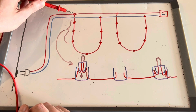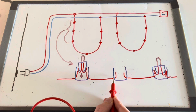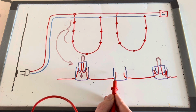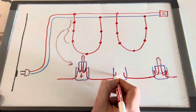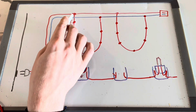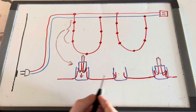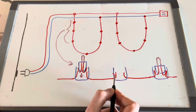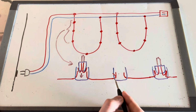And what ended up happening for me was I took a deeper look into that particular socket and noticed that the mechanical metal component where the bulb would actually connect in was bent back. So it kind of looked like this. It was bent away pretty drastically. And it's sort of a uniqueness of this connection bulb right there. These sockets are just a little bit different with how they're mechanically built. And so because the metal component had been bent back, when the bulb was plugged in at that location, there was no conduction happening.